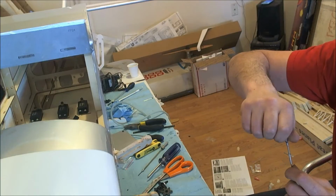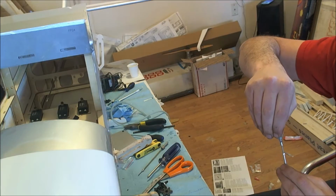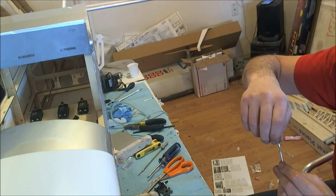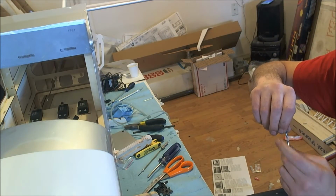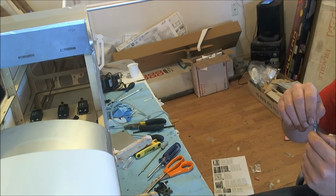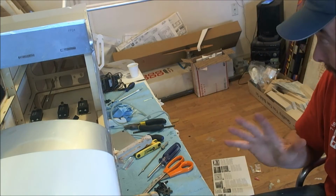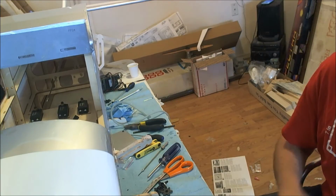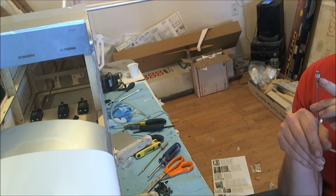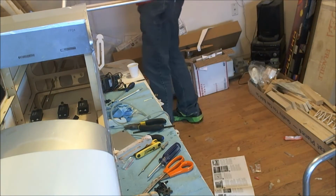And again, the same thing with this one. About 1/8 of an inch past. Slide up our jam nut. And what I'll do, just to kind of finalize everything, once I get everything set and where I like it, I will actually put a drop of glue back here to finalize everything, keep it from slipping apart.